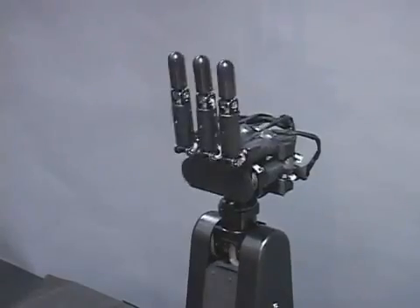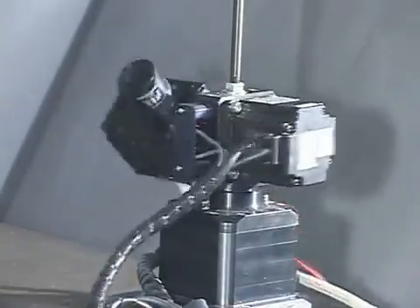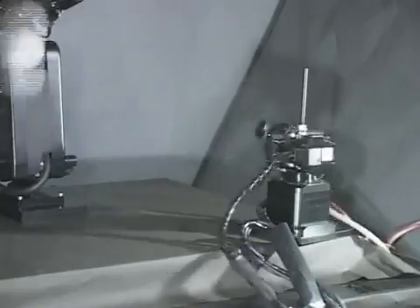The hand can close the joints at 180 degrees in a tenth of a second. The vision system consists of 128x128 photodetectors and an all-pixel parallel processing array. Using the vision chip enables various image features to be computed within one millisecond.